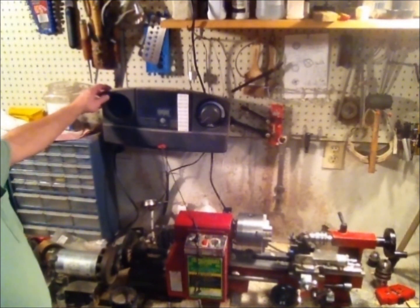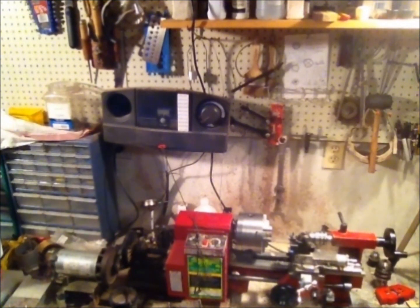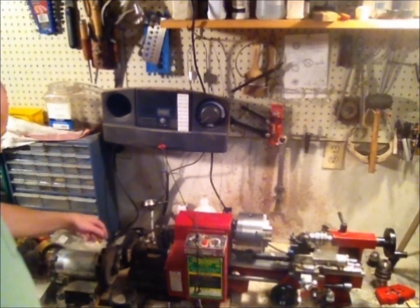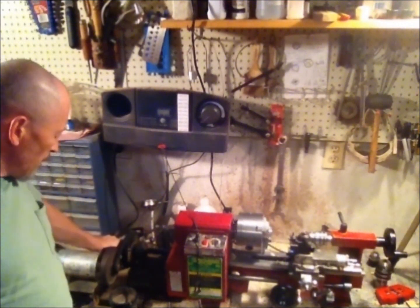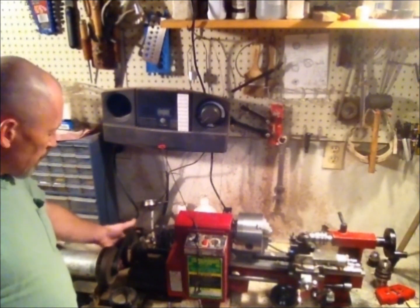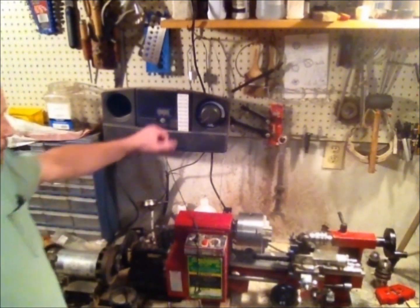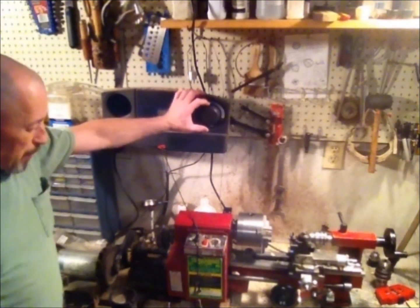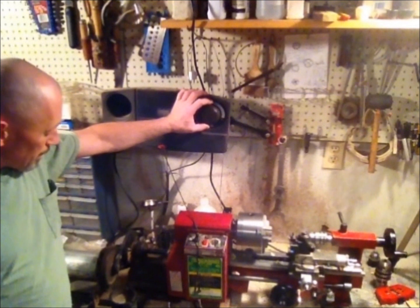and if you can see it in the video, hopefully this is the electronics out of the treadmill. And then this is my pretty little treadmill in my shop, the controller for the lathe, and it runs off of a jack shaft. I got two pillow blocks there and a jack shaft that runs the lathe. But the great thing about running it off of a DC motor is that at low speed you don't lose all your torque like you do with an AC motor.